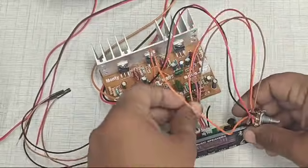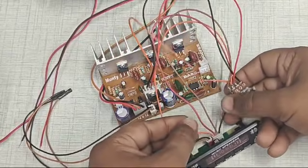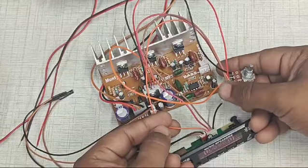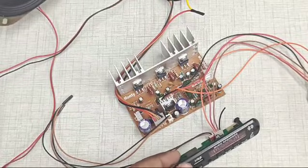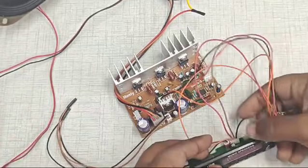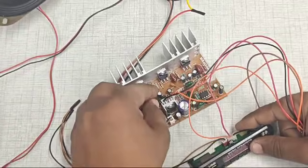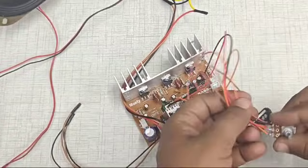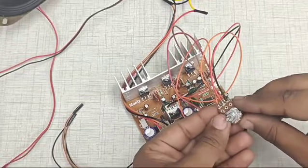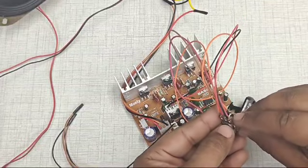The connections are straightforward. There are 4 wires — the rightmost wire is the antenna, so there is no need to connect it right now. The center wire on the Bluetooth MP3 panel and the leftmost black wire on the amplifier board — these two wires are going to connect to the rightmost pin (pin 3) of the potentiometer.